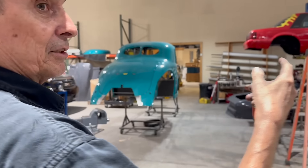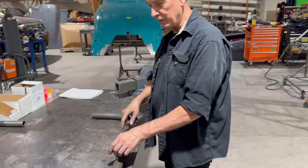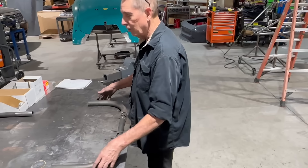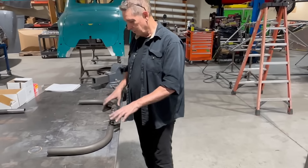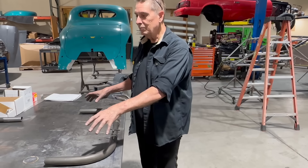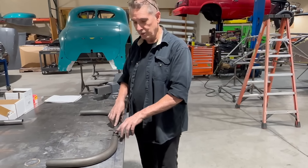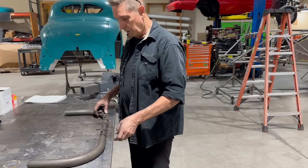This jig is invaluable for doing the bar that goes all around the back on top of the four-link brackets — we use the same jig, just put a longer tube in. This is an inch and five-eighths bend with a six-inch die. The notches are just there to help locate it on the tube — not for angles. We took this, put it in the car, and shortened or lengthened it until it laid on those two points pretty close. You can move them a little but not much, and lengthwise I just sat it in those tubes with about an inch on each side so we have plenty of metal to notch to.